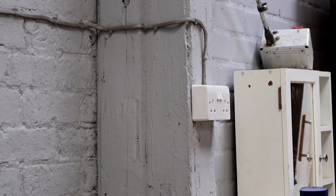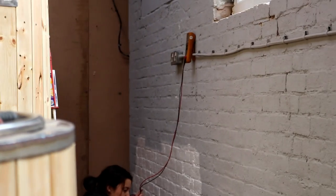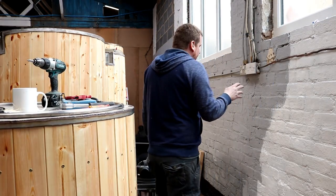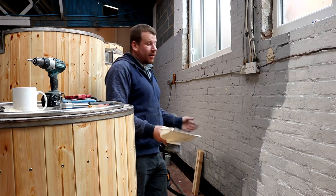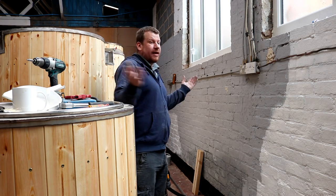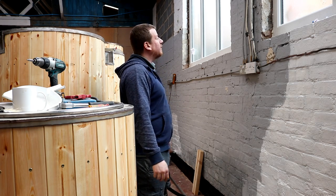So in total we'll have 10 240-volt sockets all the way down here. The good thing about these sockets is they're on a heavy 16-amp ring main with armoured cable so they can carry quite a lot of current - essentially around 32 amps, because it's like having two cables either way with it being a ring circuit.